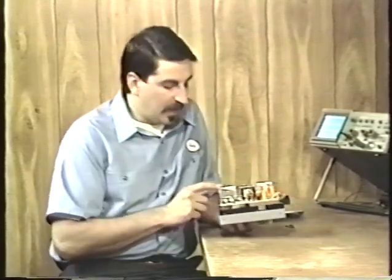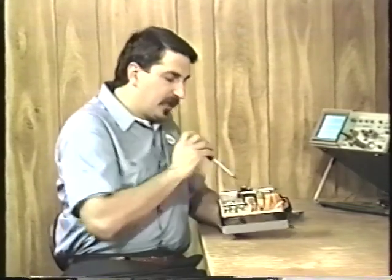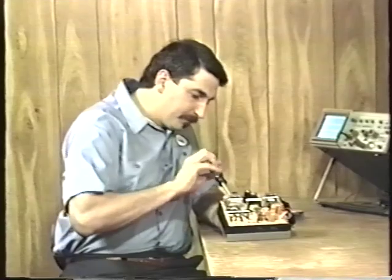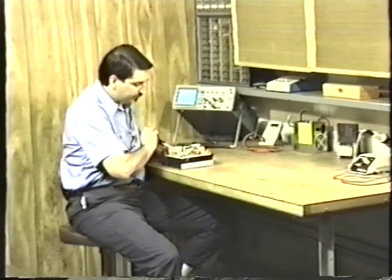This plus and minus 150 volt power supply, which is known as a split supply, is then passed through a pair of switching transistors. The switching transistors are mounted right here on this heat sink. I'll have to take this cover off, or this clamp that holds them against the heatsink, so that you can take a close look at them. There's only a single screw that holds the cover in place. Once I remove the screw, we'll be able to see the two switching transistors themselves.